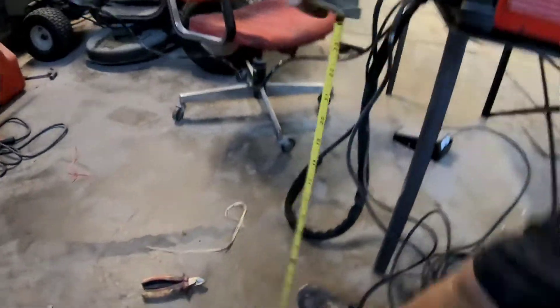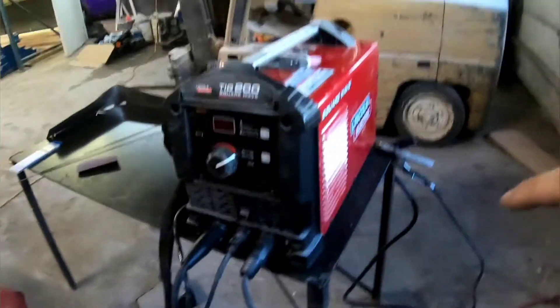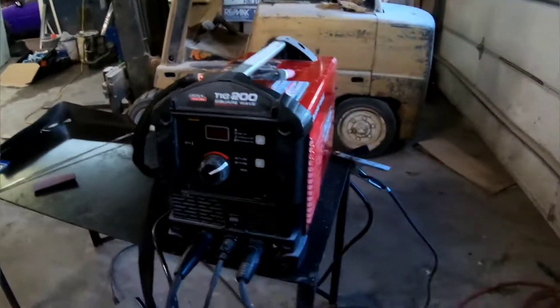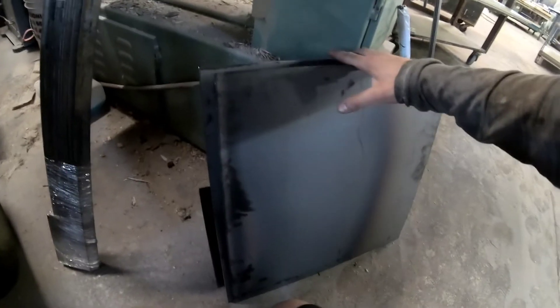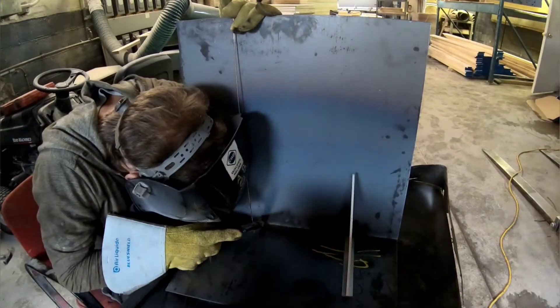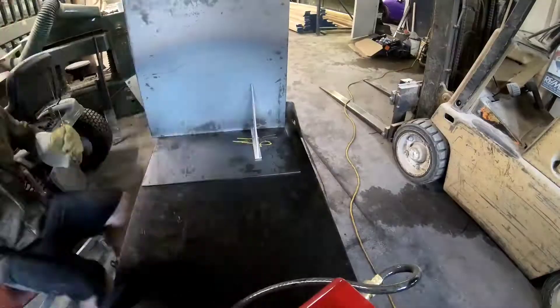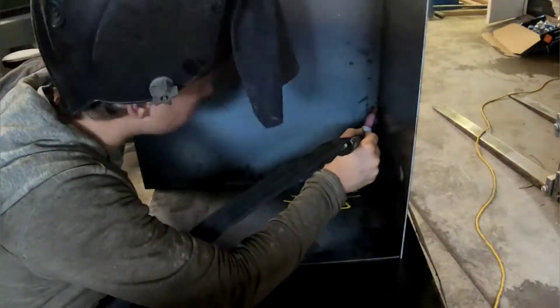I'll show you it right now. I picked a height that was easy to reach so I can still get to the knobs. It's basically four pieces, and then I've got hooks to hold my actual TIG torch — just three-inch by one-inch pieces that make a U-shape to hold it. I ordered everything pre-cut at my local steel shop. All I needed was the sheet metal and a 90-degree square tool to make sure everything is actually square. The more tacks the better — it'll help prevent warpage.